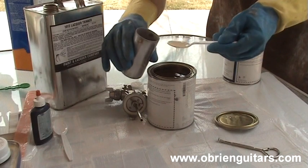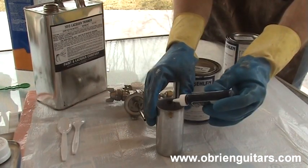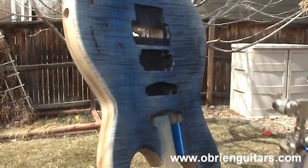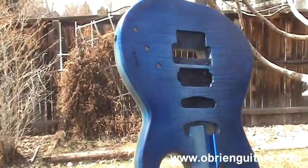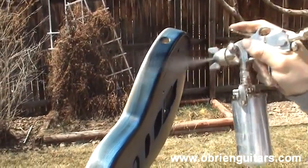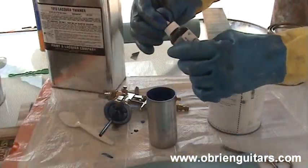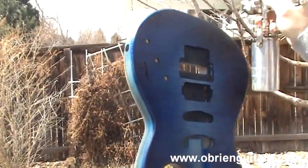Usually what I do is add the color to the lacquer — if I'm using lacquer; sometimes I use other products. I add the dye to the lacquer and then dilute it about 50%. That way I get a very thin color coat and the lacquer serves as a binding agent. I spray the guitar, being careful because the more you spray, the darker things get. If I'm doing a sunburst-type finish where I want things darker around the perimeter, I spray more in those areas, or I add more dye to the mix so it's more concentrated. I dial down the width of the fan on my spray gun so I'm just hitting around the edges.